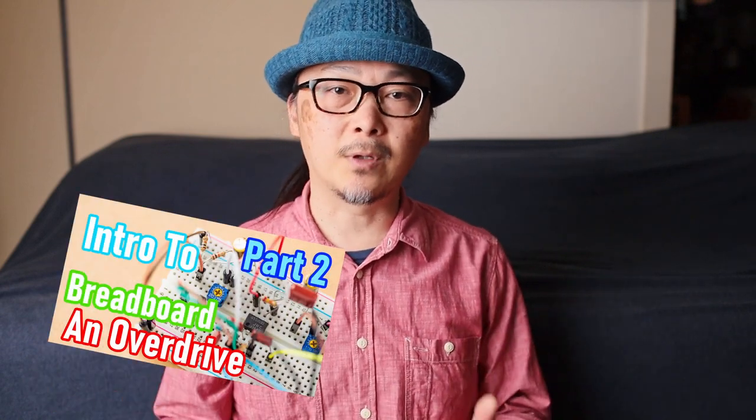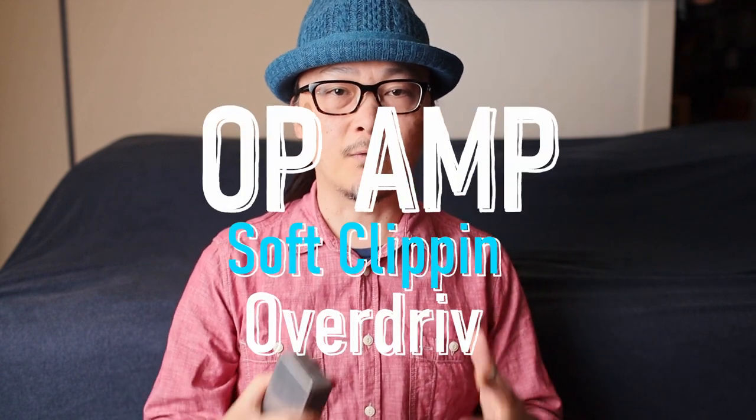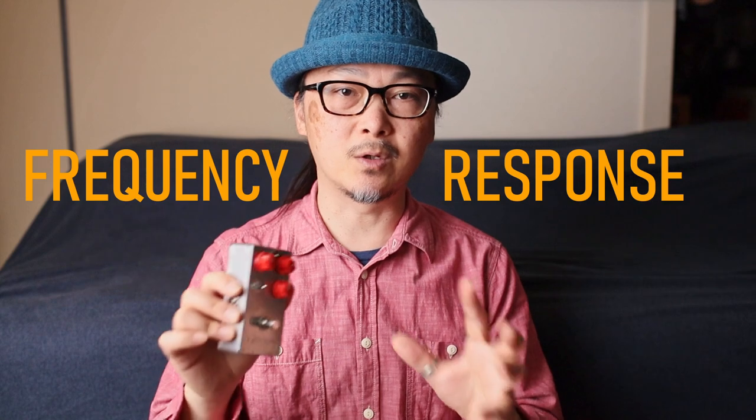And then we're going to compare this against the breadboard overdrive. And so regular viewers of my channel should be very familiar with that. It's just a very typical, extremely simplified op-amp soft clipping overdrive. And so it's a very different way to achieve overdrive breakup compared to something like this. So we're going to compare the two tones, but it's not going to be a straight-on comparison because the frequency response is very different between these two pedals. So it's not going to be an exact comparison, and it's going to be very difficult to know what you're hearing, because you're going to hear more bass in one pedal and less bass in the other, and whatever, more mid-range. And that's going to affect how you hear and perceive the breakup.